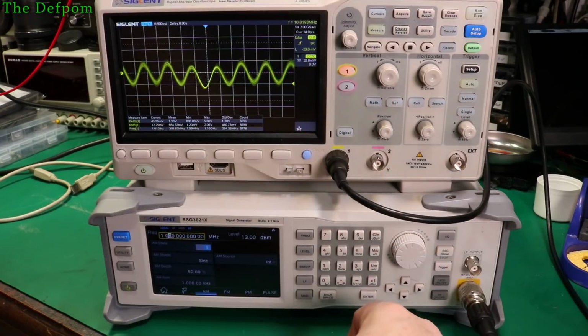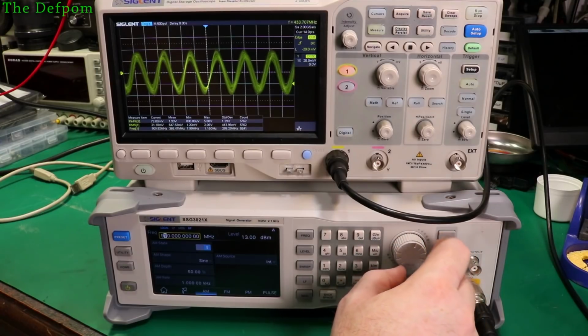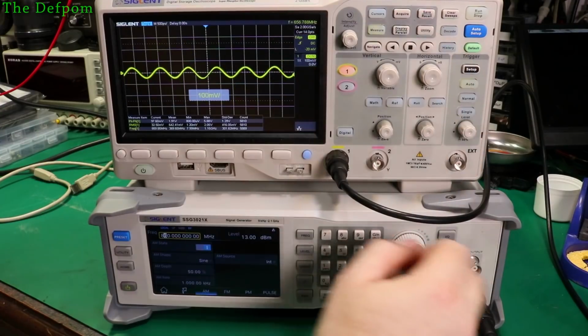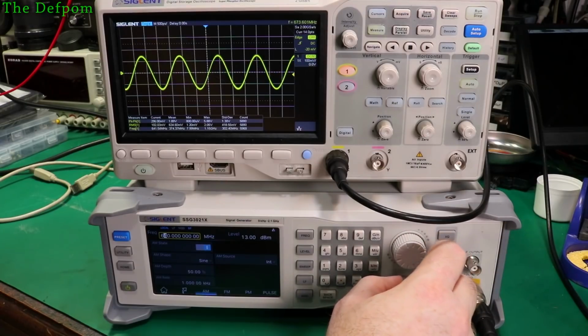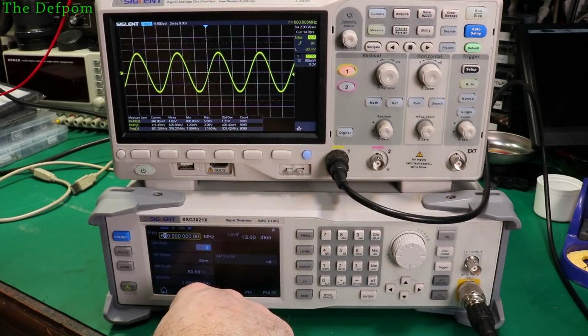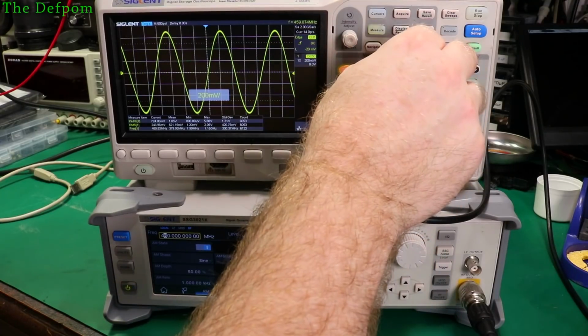Obviously, you can't use it there. That'd just be ridiculous. You can't do that unless you want to verify that it actually is a signal. That's about it. But yeah, the Nyquist ratios and stuff will just be no good for it. But even that, and that's 600 megahertz there, and that's like a usable waveform. So that's pretty impressive, really.